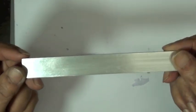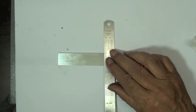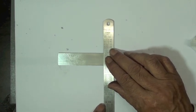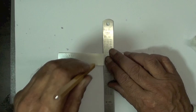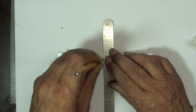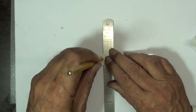So we want to produce a mark on the surface that's visible but does not modify the surface, and that's the definition of a burnish. The pencil will actually flatten some of the peaks that we created through the sanding process without changing the thickness of the aluminum beam. So he's going to go back and forth a few times there, and produce a pencil mark